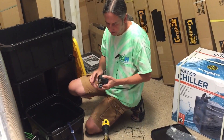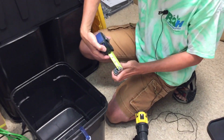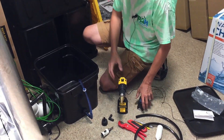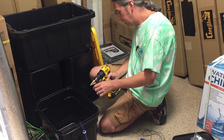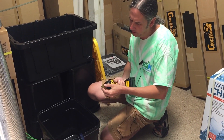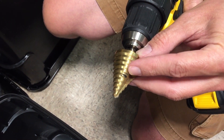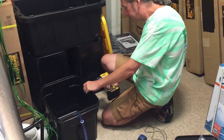You're going to need a tape measure here. We're aiming for a three-quarter-inch hole to get through the sidewall of this bucket, and it's real easy to do. Anybody who's got a step bit or a three-quarter-inch hole saw can get this done. When I use this step bit, I kind of just step it in one at a time. I've got a black line on here where I'm going to stop, then I check it, try again, make sure it fits good, and go from there.